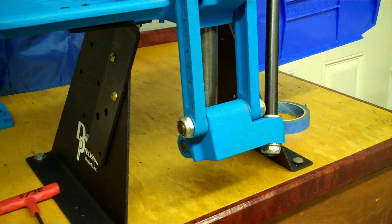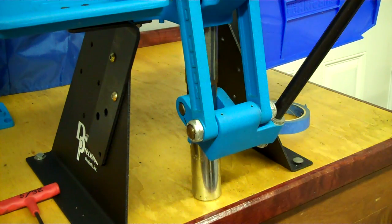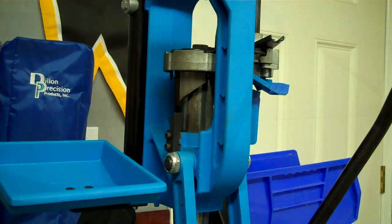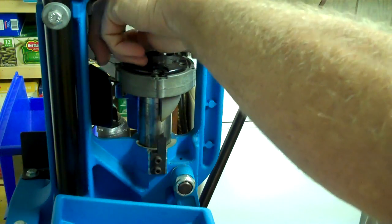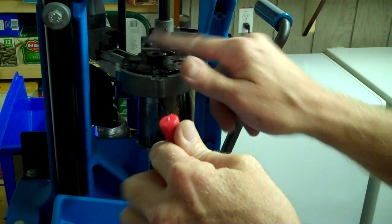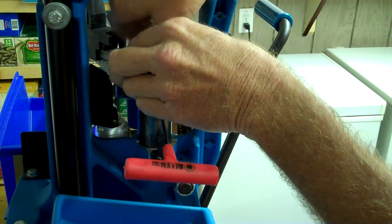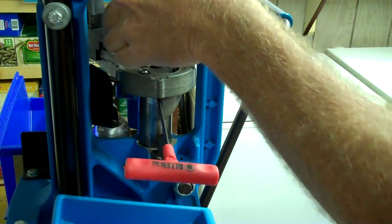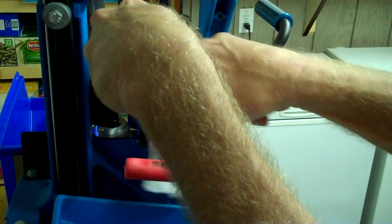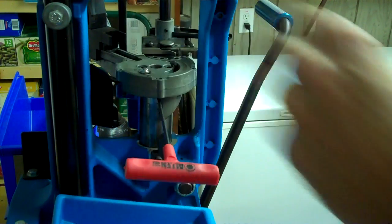Now we're going to get ready to change the shell plate itself. I use an old half-inch socket extension to jack the handle up to just the right height to keep it raised so I can get to the set screw and change the plate. I also need to grab the ramp here which slides the case onto the shell plate. There's a set screw for that bolt — and even though there's a big Allen head there, you should never need any tools for this part; it should always be just hand-tight. Lift it off, and this is a great time to come in and really clean up. I don't like any lubricants under there because powder sticks to it.